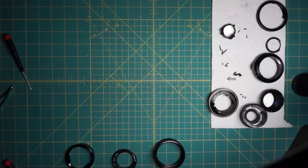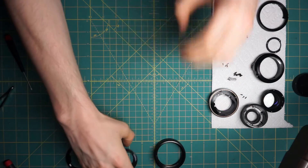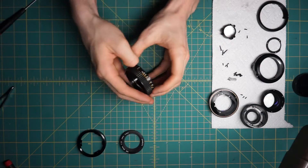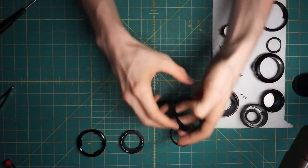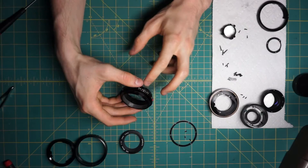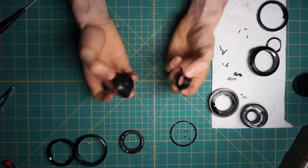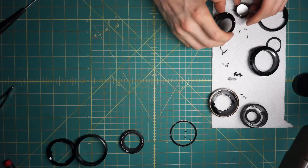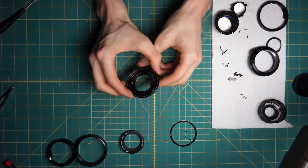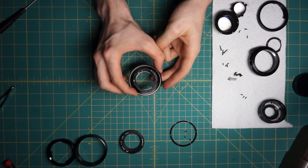So that's got the disassembly of the lens complete. As you can see, there aren't that many components — very similar to the MD 50mm F2 lens, just a few really well-integrated components. So you can't really make the same types of repairs that you can on some of the MC lenses, which have many more components. Those are much more repairable, but this one is a whole lot easier to take apart. You have things like the focusing ring, the filter ring holder, the main body section with the depth of field scale, the front and back optics, the diaphragm with the inner part of the focusing mechanism, and the back mounting plate ring with all the mechanical coupling.